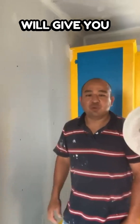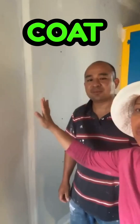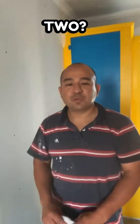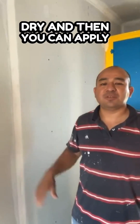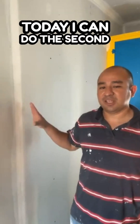That will give you a nice level surface to get a finished product. How long does it take to dry for the first coat — level one — before you can proceed with level two? You want to give at least one day for the tape to dry and then you can apply your second coat. If I put the tape today, I can do the second coat tomorrow.